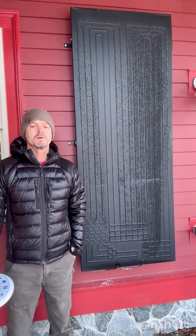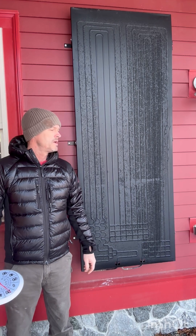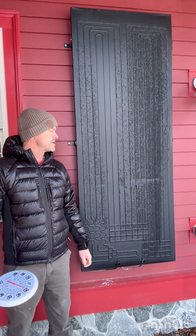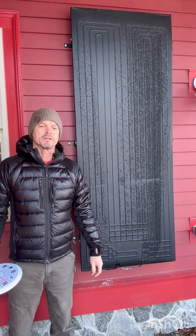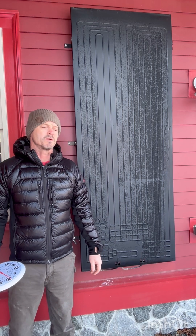Hello, I'm Bruce from New England Solar Hot Water. We're an installer of the Smart Solar Solar Assisted Heat Pump Water Heater. The main advantage of this system is that the heat pump evaporator is outside. This panel is an evaporator, and that eliminates the need to steal heat from indoors to run a conventional hybrid heat pump water heater.